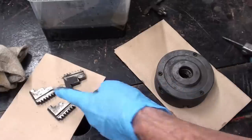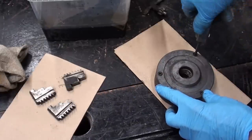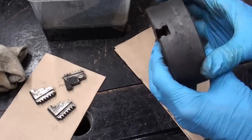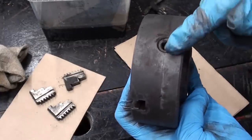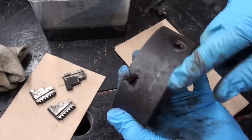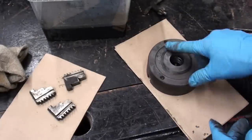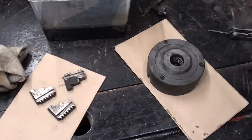The jaws are wiped off a little bit, and I've already loosened these four cap screws — they were quite tight. Now, this chuck has a dividing line, a parting line — can you see it right there? If there were three of these instead of one, I would put an index mark on there somewhere, but there's really only one way to reassemble this, so I don't need to worry about that. Let me take the screws out and see if we can get it apart. It probably will not be easy.